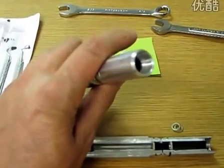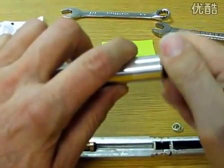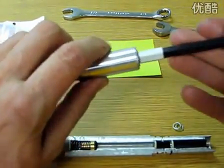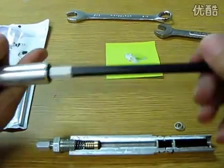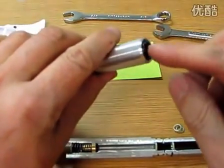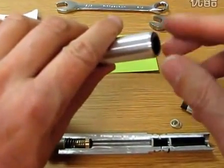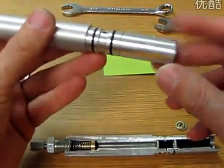So lastly, we take our nut and we screw the nut in. And we use our Allen wrench and we tighten it up. And you're going to notice here that I'm going to just kind of snug it, not particularly tight here, tight enough to get it to stay. Some of these have worked their way out. If yours start coming out, you can put a drop of Loctite on there and lock it into place. But now you have a completely rebuilt cylinder.